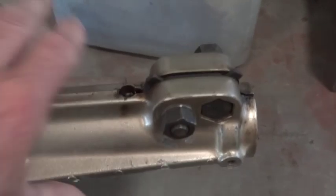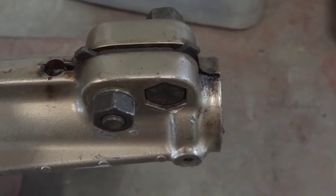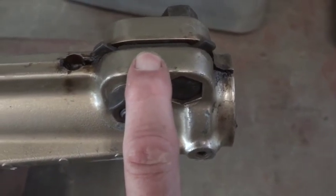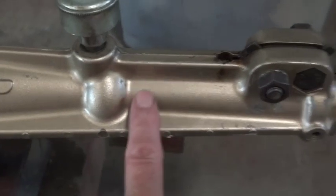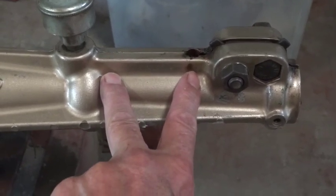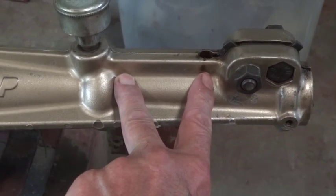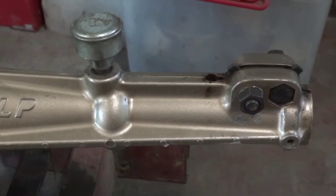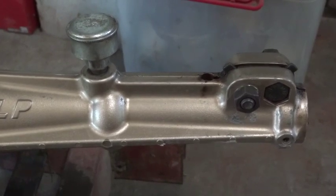Here's the PTO, or the hub. The outer shaft slides into this and it's bolted and clamped down here. This clamp holds the outer shaft down, and the inner shaft goes in here — there's a bolt fitting that provides the female fitting that the shaft slides into. It's a loose fit — there's a little slop to it on purpose because that slop takes the thrust load off the bearing.